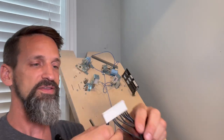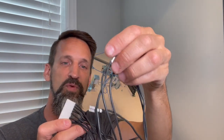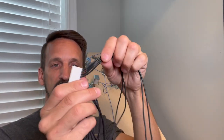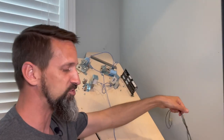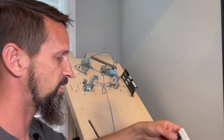And then these other wires now, these wires have quick connects on them. These wires are specific to the actual coils we want to control, okay? I've got a handful in here. We're going to focus on the first six, because we're going to need six for our four items, two per flipper coil, and then one more for each of the slingshots, okay?